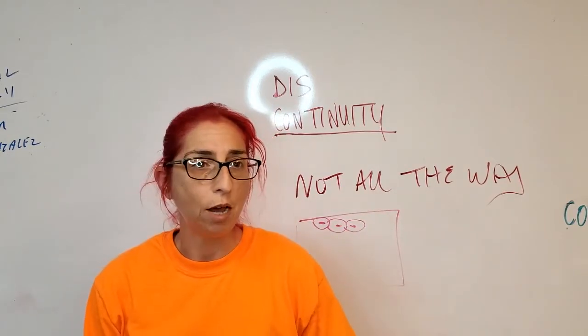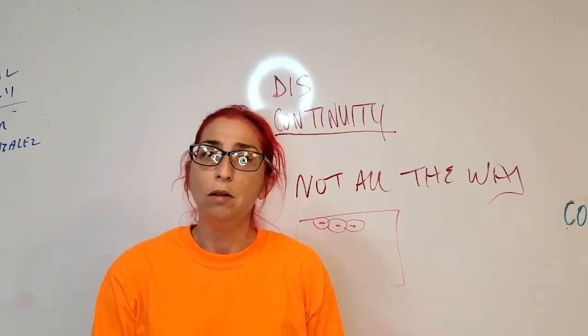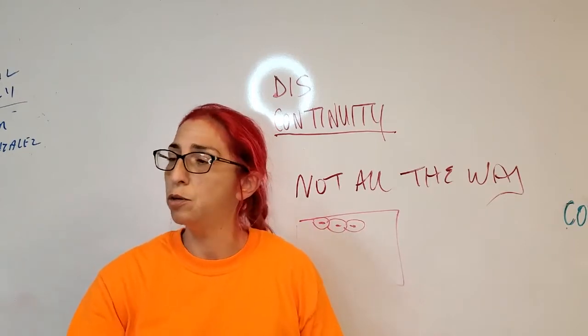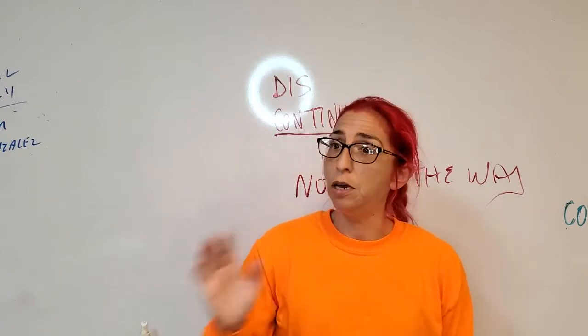A lot of people will have issue, especially in the beginning of the weld, usually with porosity, because they may strike farther away. And sometimes at the end, with porosity as well. So be very, very close and pay attention to what you're doing near the ends.